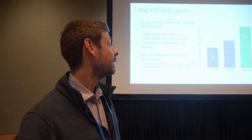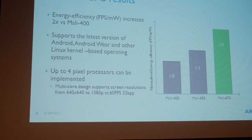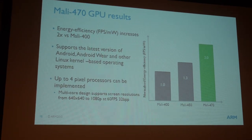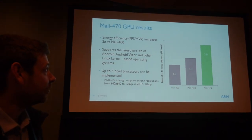Prior to this slide, we've looked at the dynamic and static power changes which have occurred within the graphics processor. We can see the result of all those changes was a step-change increase in energy efficiency compared with the previous generation. The Mali 400 and Mali 450 are shown in grey on the left-hand graph, and the Mali 470 in green — showing normalized energy efficiency in FPS per milliwatt. We get a 2x increase in energy efficiency, which means half the power consumption — a major, major reduction.